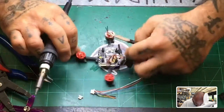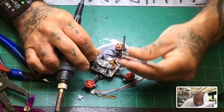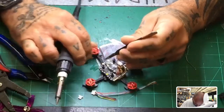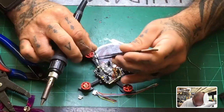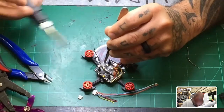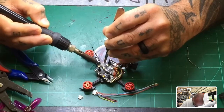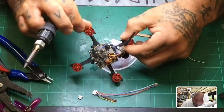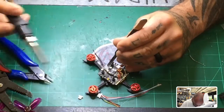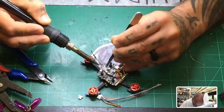We've got the camera on. Now we're going to do our VTX wire — this is going to go to the back right here. I'll just move those antennas. Ideally I would do this before putting the receiver on, but I had already committed to doing that video first. In the worst case I have to take the receiver off to get to this properly, but I think I can do it without that.